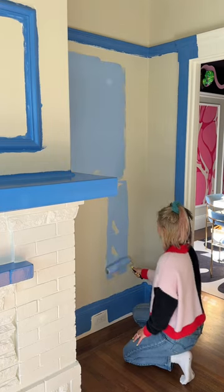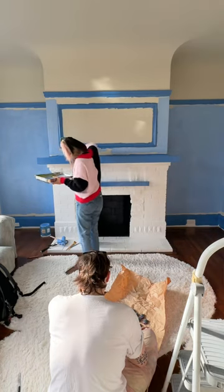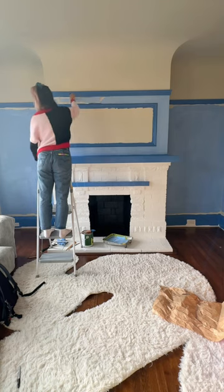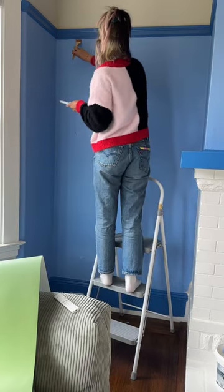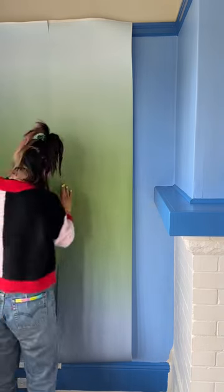Best practice is you're supposed to paint behind your wallpaper — I don't know if I agree it's necessary, but it's supposed to help hide any issues if your seams don't match up perfectly. Since this isn't peel-and-stick wallpaper, I use wallpaper paste to put this down, squeegee out the excess paste, and line things up.